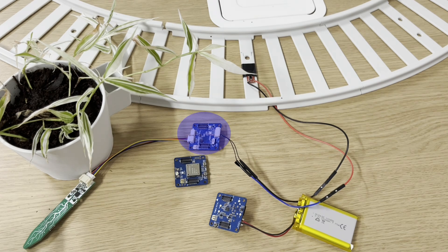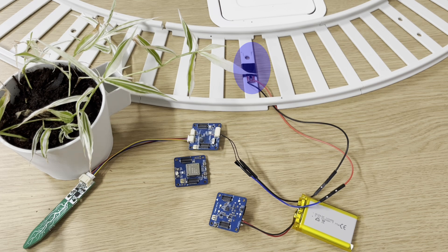The Environment Pedal allows the pot to interface with its surroundings. The connection on the left goes to a soil sensor which can measure the temperature and capacitance of soil — the capacitance tells us how wet the soil is, since as moisture content goes up, so does capacitance. The other pair of wires on the right goes to an IR sensor attached to the track, used as a beacon to tell the robot to stop. When the plant has requested a watering, it turns on this IR sensor, which sends a beam of infrared light that the sensor on the bottom of the robot can detect.